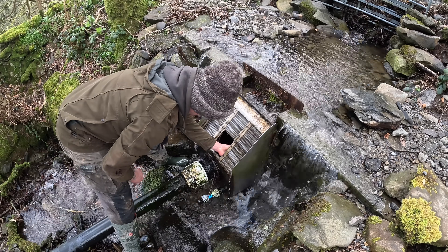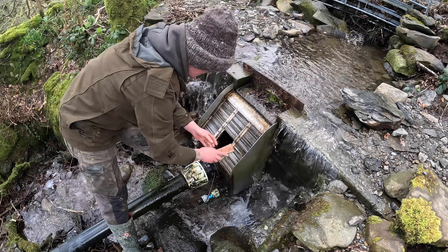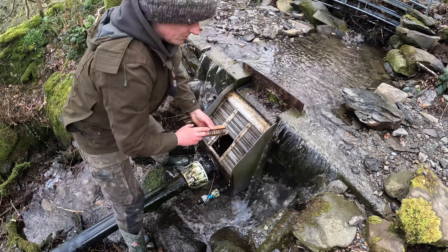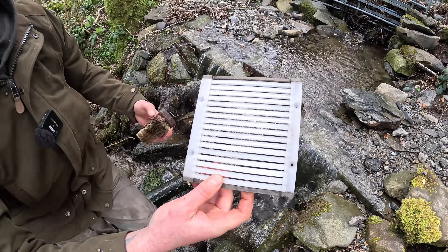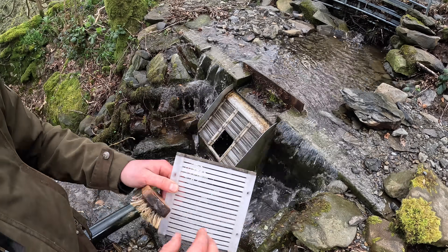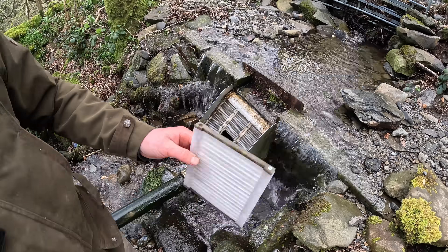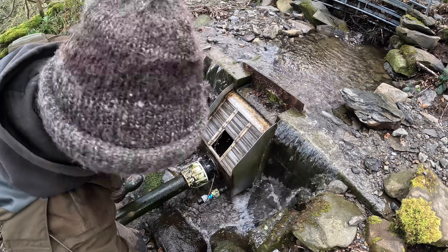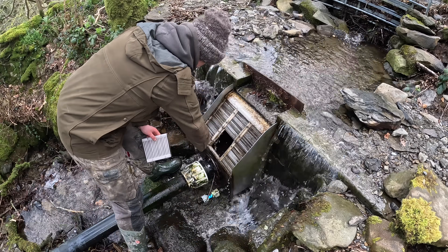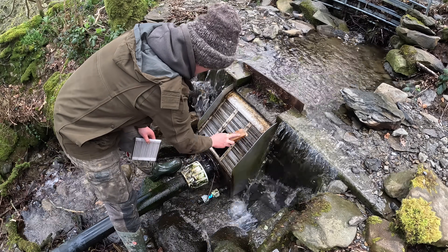Because I'm going to be putting a bigger nozzle on this to get a bit more power out of it, I'm also going to be upgrading one of the panels — maybe even a few of the panels if it works out to be effective — to ones with a bigger gap. I've got these ones here which have a gap that's twice the size. We're going to trial running one of these and see if he gets less blockage issues. Hopefully it doesn't let too much through — small leaves and things will get through, but the nozzle and turbine can take that. I'm just going to get this cleaned up and back together and then we'll see if we're getting the expected output. I think there's just about enough flow here for full output.